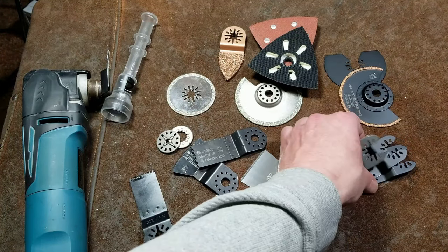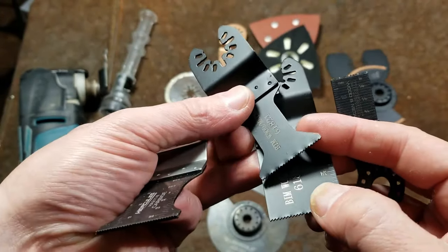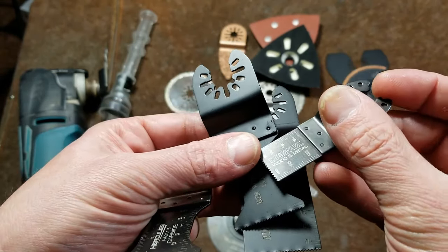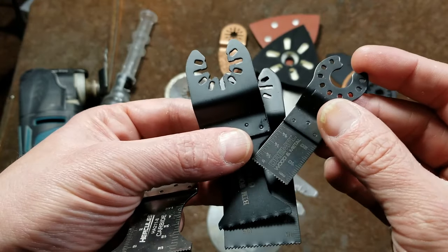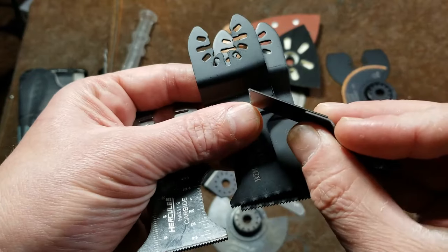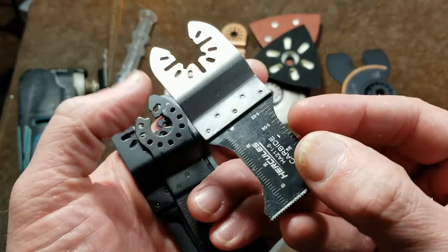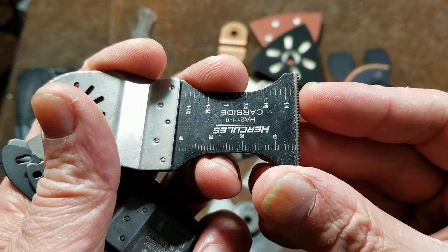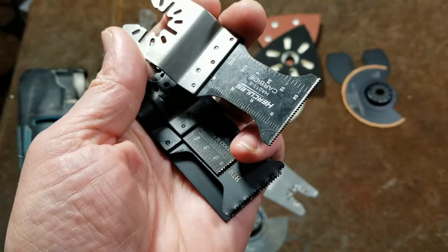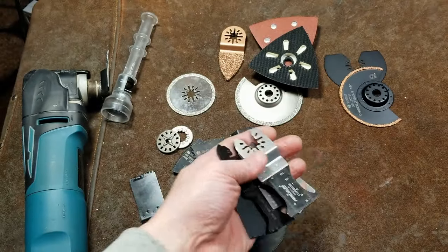Of course there are fine tooth blades in various styles. We have ones with a cut-out so they can really reach into extremely tight spaces, wide ones, and short little stubby ones. These are bi-metal — high-speed steel edge with a softer steel backing — and they're good for cutting through nails and other small things. Even Harbor Freight: I picked up one of these Hercules blades that actually have a brazed carbide edge, so these will work through various steels and hardened metals. It won't be very fast, but it will certainly get through some pretty tough materials.